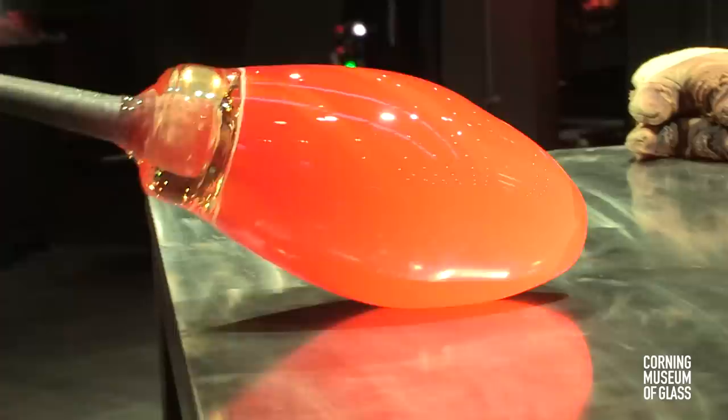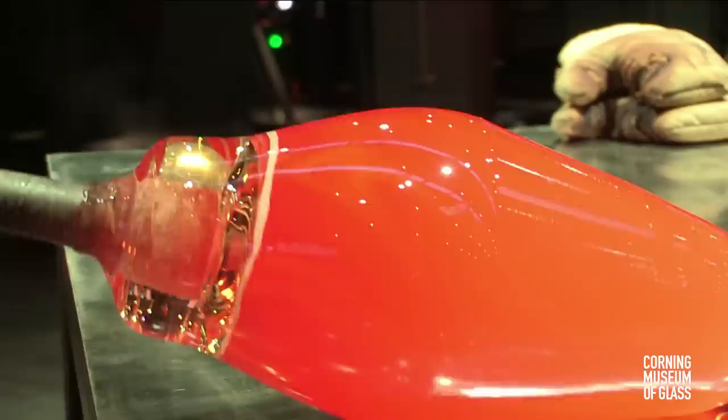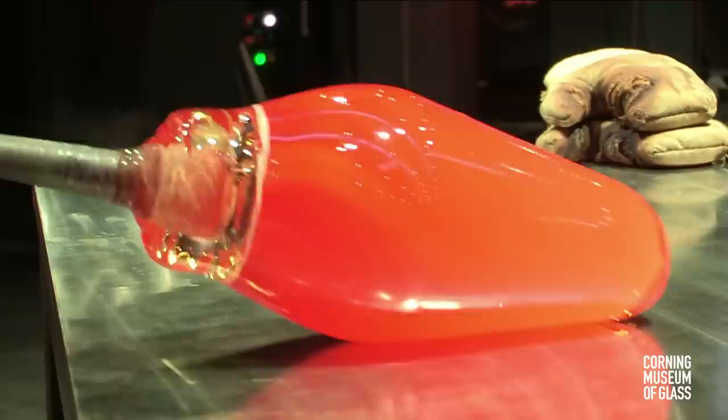And he said right after he gathered this, the cornucopia piece, he's going to dump it out is what he calls it. So he'll let the glass really start to stretch quite a ways and create the tail section of that sculptural form and do some curving to it before we work on the opening. But traditional glass blowing is where we begin on a blow pipe. And all the pieces down here that were made at the demonstrations start off on a pipe. We inflate to the volume that we're looking for, and then we'll flip the piece around 180 degrees to work on the opening, and we'll see that at some point here.